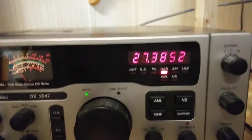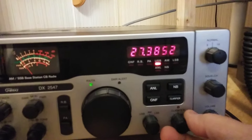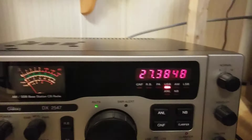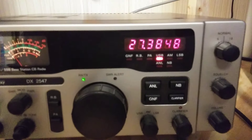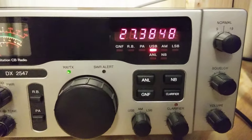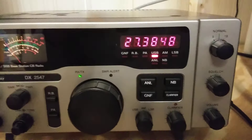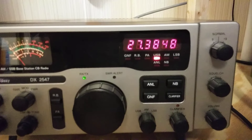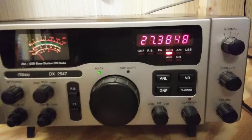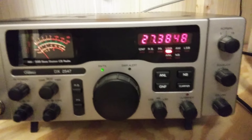So it was horrible. I used an external frequency counter and got it perfect according to the external counter, so then these would both be the same. But the display was off. There's a separate adjustment right on the back of the counter — the display board, or the counter, it is a real counter, I believe. A lot of these radios it's just a display, it's not measuring anything. But whatever way it is on here, it was wrong, it was off. So I found that adjustment — it's actually depicted in the service manual, not the book that comes with the radio — and once I got that right, it matched my external counter, and I've been satisfied with it ever since.